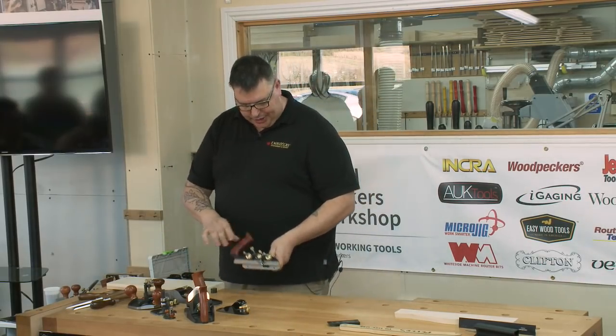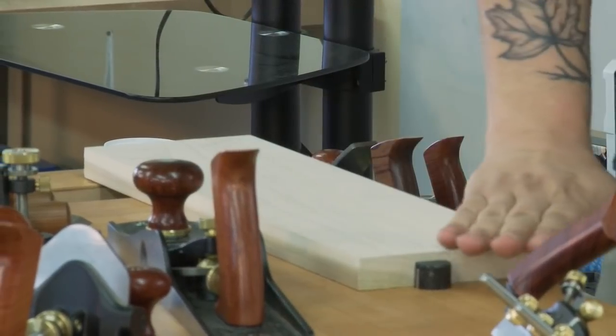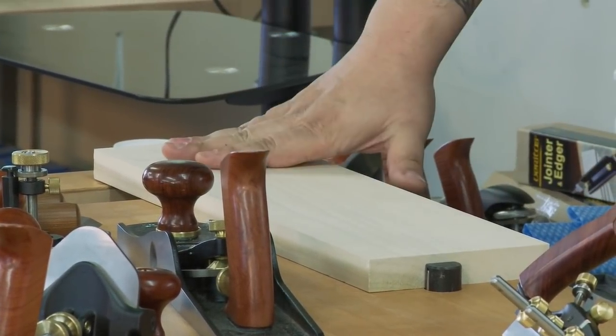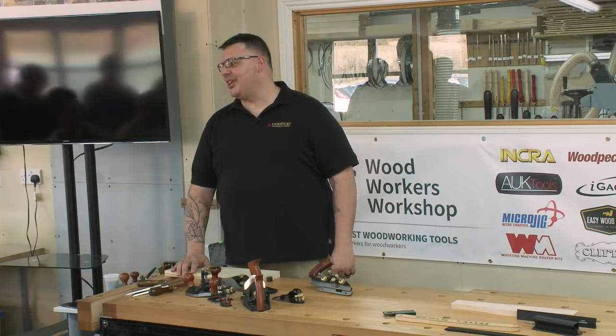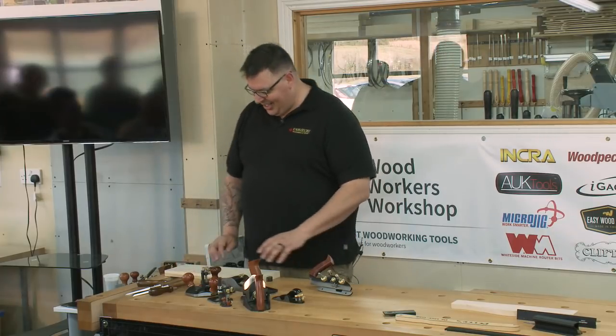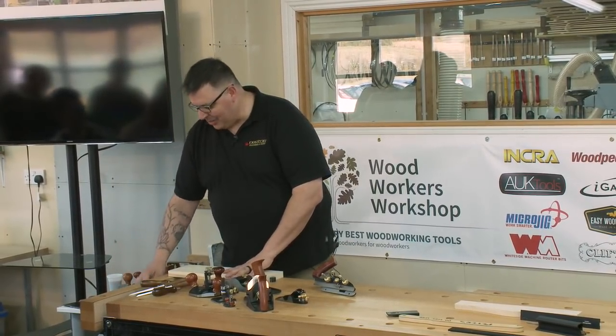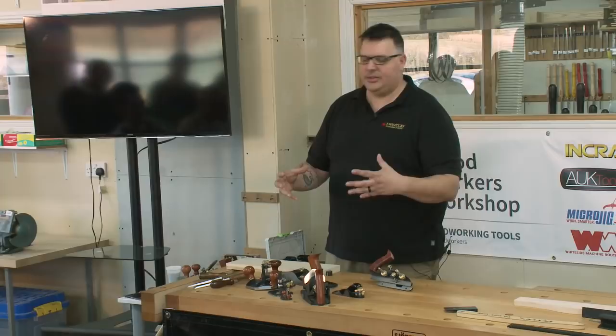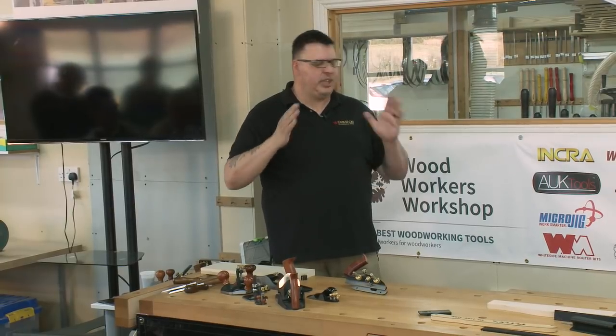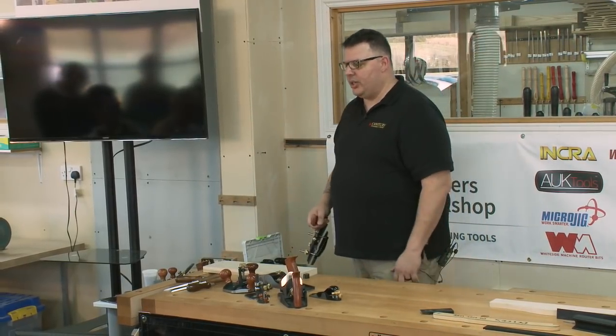When you're working on the timber itself, always make sure you mark your boards so that you know which is the inside and which is the outside, okay? There's nothing worse than picking a beautiful drawer side, drawer front that has beautiful grain and then messing up what direction you're going to put the groove on, because once you put the groove in, that is now the inside of the drawer, whether you like it or not, right? We've all done it, and we will all continue to do it, but it's good to try to keep track of that kind of stuff. You must teach the cabinet maker's mark, the triangle, right? Yeah, so that you can know which is the inside and outside surfaces.